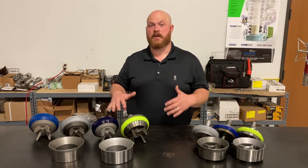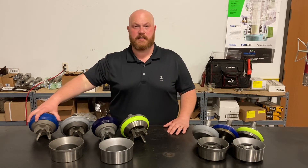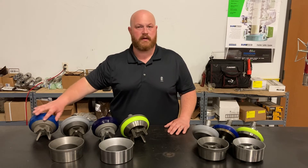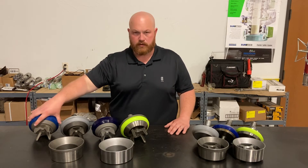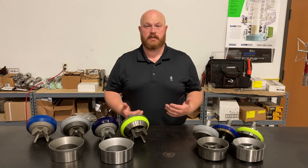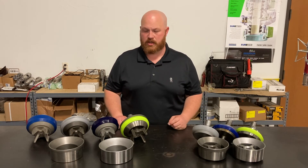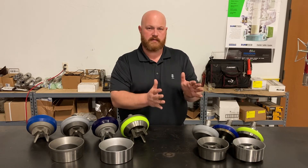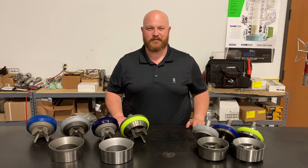If you find yourself in really extreme conditions, the Patriot HT is what we'll recommend. This is our highest performing urethane — it gives you the best resistance to solids, it's a bonded valve with a 300-degree temperature rating, and it performs remarkably well in really high temperatures. Since the conditions you face from well to well and region to region are going to change, we've created a line of valves so you have options to pick the best value for each of the conditions you're going to face. Thanks for taking a look — see you next time.